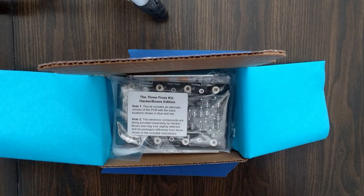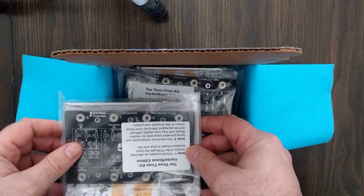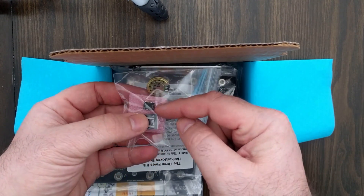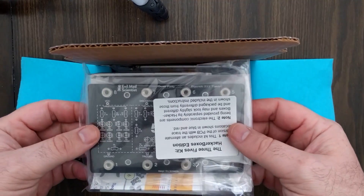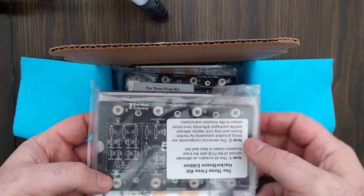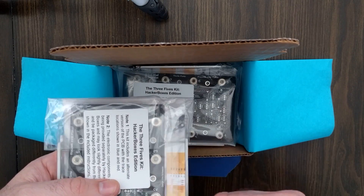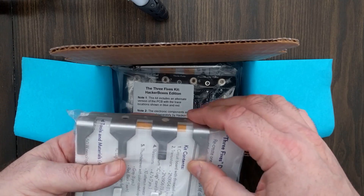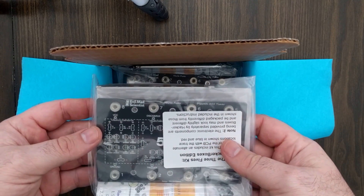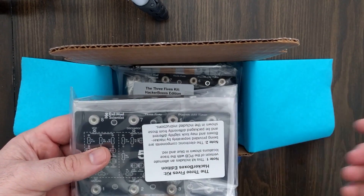It was designed a long time ago so it only has 26 transistors in it. What's interesting about this kit is that it has a circuit board that actually implements the circuit inside the integrated circuit. The integrated circuit for the 555 is a little 8-pin package — it's very tiny. So this is basically just a gigantic one of those, and it has the places where you'll solder in the 26 transistors — 13 NPN and 13 PNP transistors. There's also a nice instruction sheet from the folks at Evil Mad Scientist. Once you build it all up, there are cool legs that are kind of like the legs on the 8-pin chip itself, making just a really cool big replica — basically a gigantic 555 timer. And it actually works. There are little screw terminals you can connect to the circuit and use it just like the little tiny 8-pin chip.